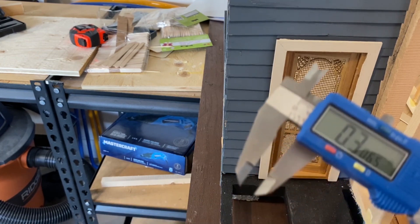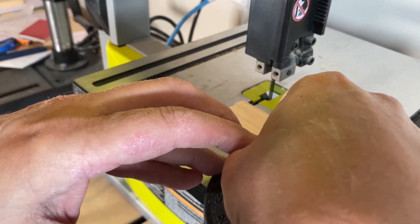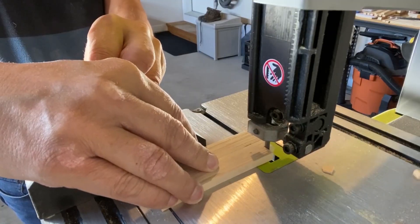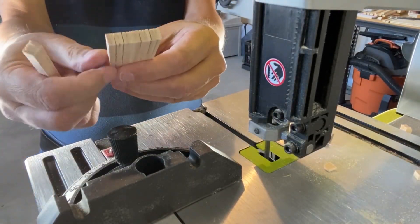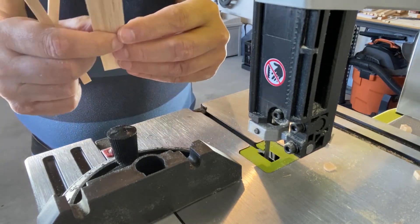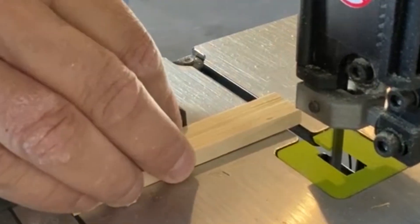It gets really tricky to sand wood with a belt sander when it gets really thin. I took the glued bundle of popsicle sticks to my band saw and cut off the rounded edges. Remember, I only put a little dab of glue on each end of the popsicle sticks. Once I cut off the rounded edges that had the glue, I could easily take apart the bundle. The popsicle sticks came apart quite easily and they're all the exact same width — some at normal thickness and some doubled up. This is way better than trying to cut the popsicle sticks individually using an X-Acto knife.